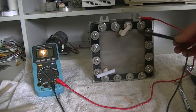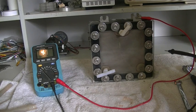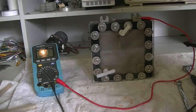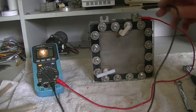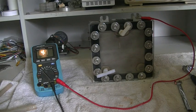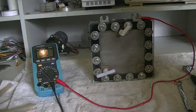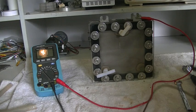Our cell is all cleaned and back together. We found a problem that must have existed before I pulled the cell apart, because it went back exactly the same way. We'll have a look at that problem in a little while, but first, now that the cell's back together, we've got to make sure there's no shorts across the plates. This is quite time-consuming because it's a 15-plate cell, so we have to make sure every plate is isolated from one another — that's 15 by 15 probe placements across each individual cell.